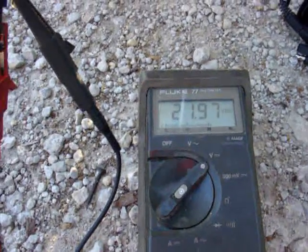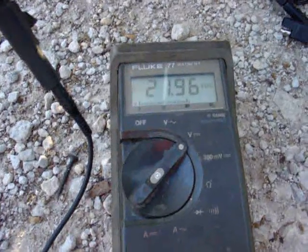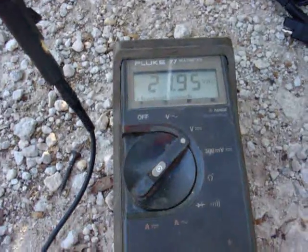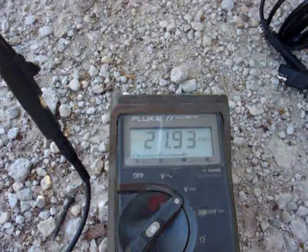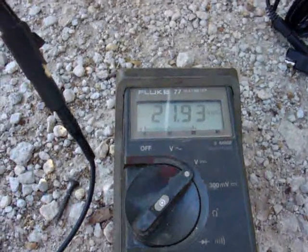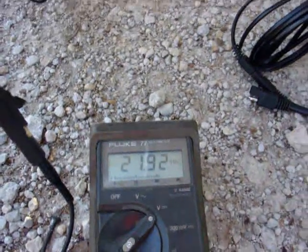The sun is just coming up, it's at a very low angle, and I've got 21.97 volts — that's close to 22 volts. I had 22.6 a minute ago, got a little bit of cloud cover. Hooked up to one of these solar panels: 22.95 volts DC. That's nice, and it's going into a 12 volt battery. It takes almost twice the voltage of the battery to put a good charge on it. 24 volts is good, 21 or 22 volts is real good, especially for the morning with the sun just coming up. It's not hitting these solar panels at the right angle, so I'm going to tip them forward just a little bit.